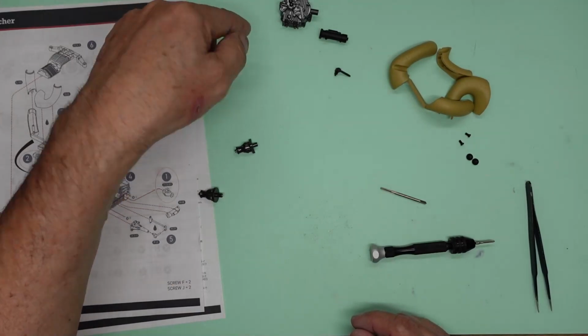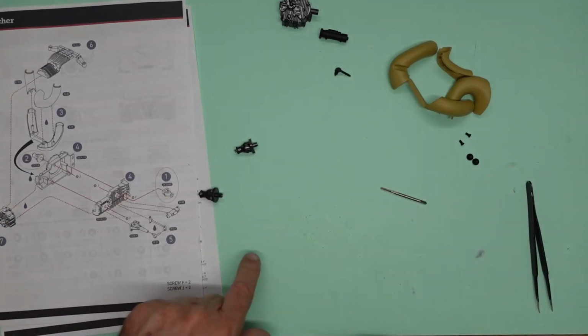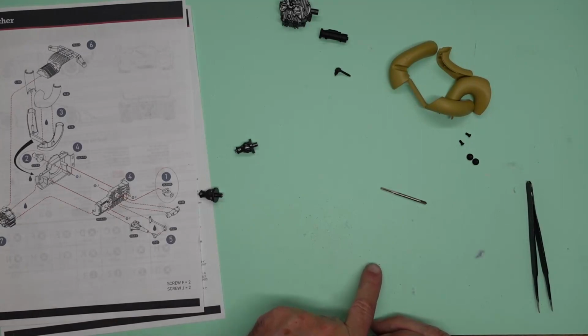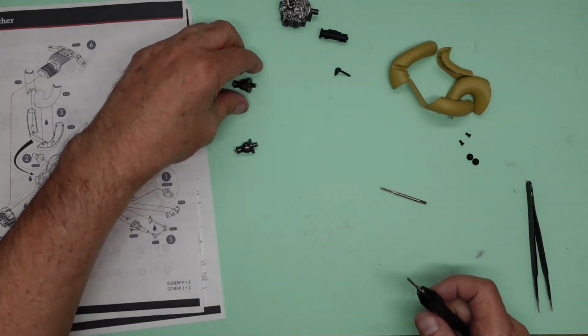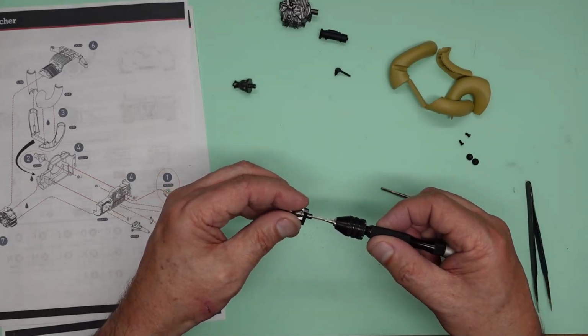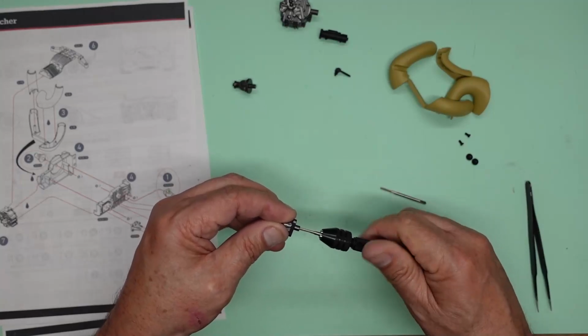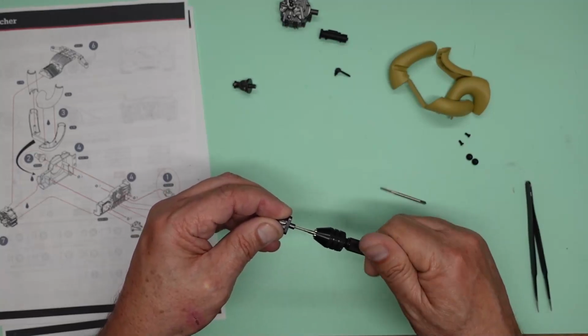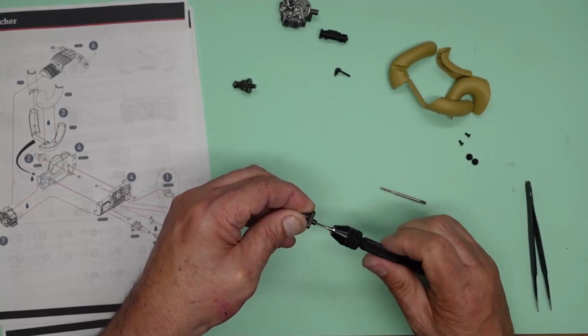So if you just kept going, you would just keep producing this long line of swarf, just like a lathe tool does on a lathe. So what you do is you come back and it breaks it off, and you end up with all these tiny little bits of swarf rather than having one long line, because one long line will wrap up in the tap and jam everything up. So look at it, nice and square, just like that, half a turn, and then go a turn, back half. Just like that. You can see the swarf coming out.